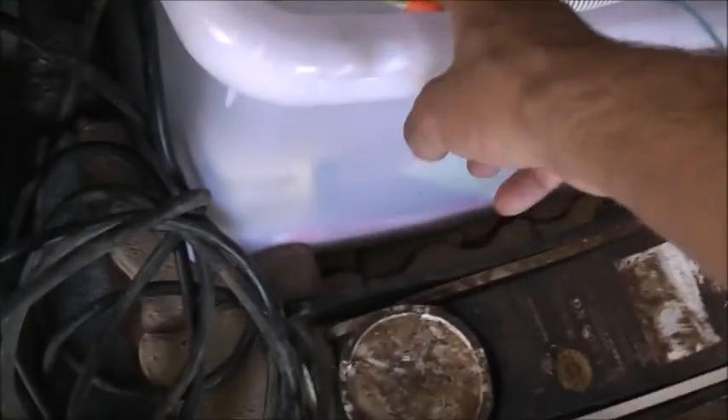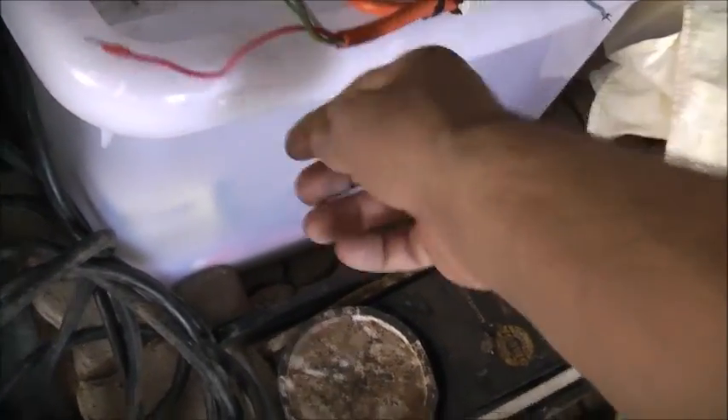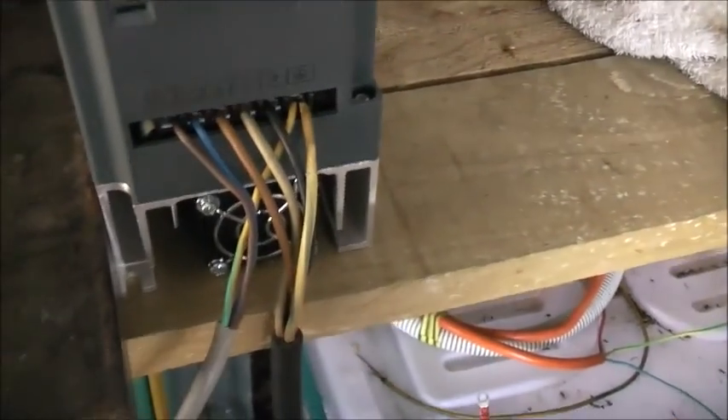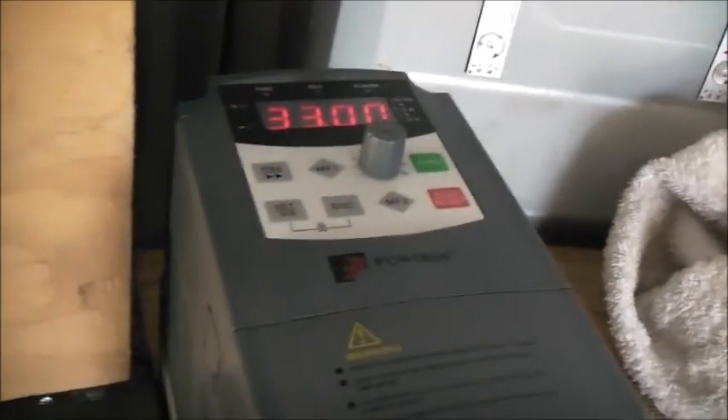You're actually supposed to use a shielded cable — it's got like a clear coating on it and braiding inside. The whole idea of that, if you're using it in a factory out in the field, is the shielding. They make shielded ones for VFDs to actually stop interference — to stop the RFI interference these things are going to put out.